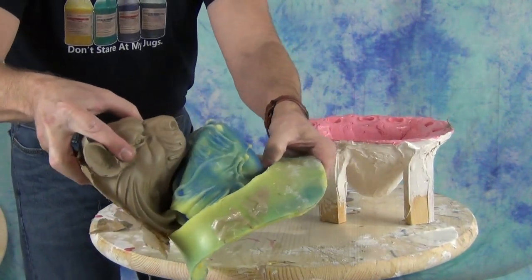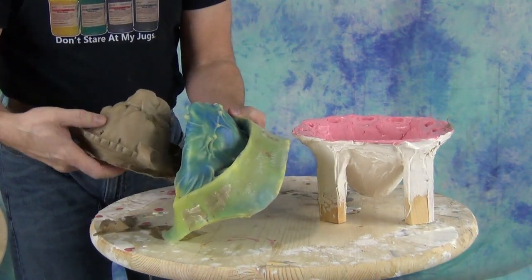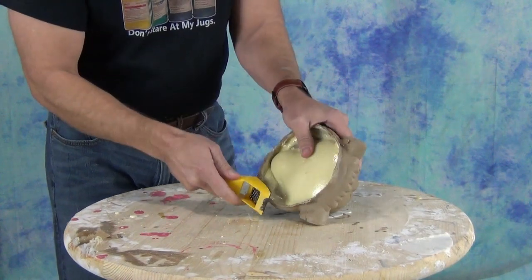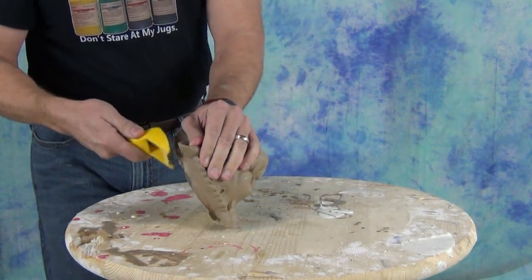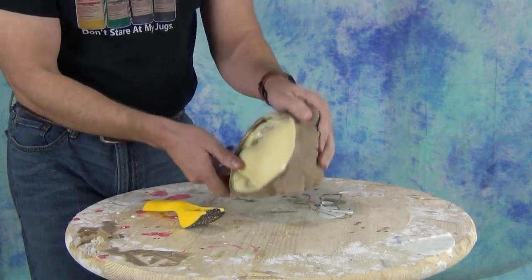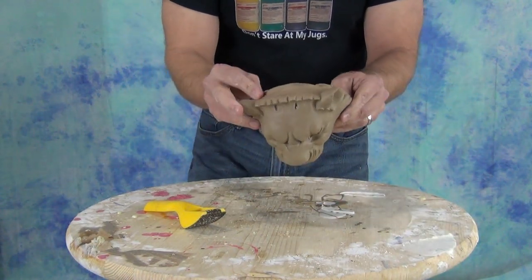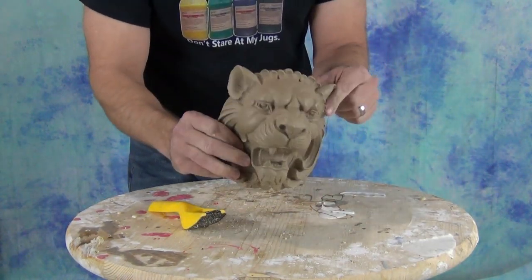The other thing to keep track of is the resin surface — if the resin skin is too thick, we can back off that amount, because too thick a resin skin is wasted money. For quick cleanup, we go around the edge and remove the flashing using a wood rasp. A little tool like this, available at most hardware stores, is a great way to clean up resin flashing. Anything finer we can do with a Dremel tool or sandpaper. And there we have our cast part — nice and strong and ready for faux finishing.